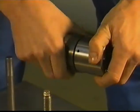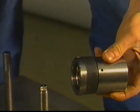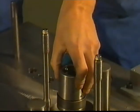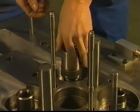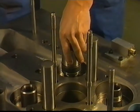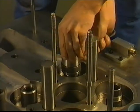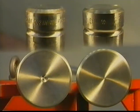Check manually the condition of the valve rotator mechanism. Turn the lower part of the valve rotators on the valve guides of the exhaust valves. Use a hook spanner. The dimensions of the in and exhaust valves are the same. Valves differ in materials and must not be mixed.